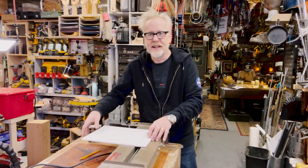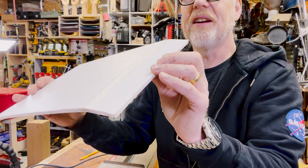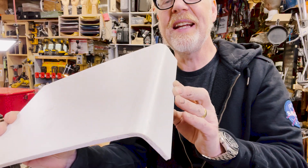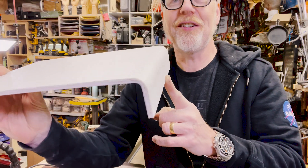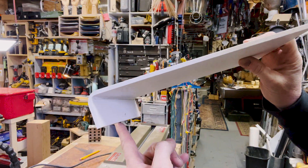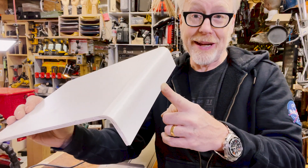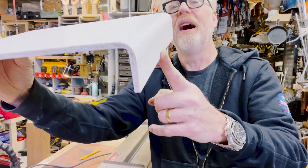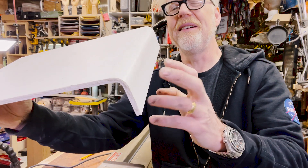I'm going to turn this off, pull off the weight, and here we have this piece of plastic which has been heating. You can see it's slightly discolored — I might have left it on there just a little bit too long — but look at this. Now I bend it, and I get this beautiful linear bend. Look at that — that's a real professional bend. I really dig that bend. This is terrific. You can hit this with a spritz bottle if you want, or just wait for it to air dry. You could make yourself a little clamping system, just clamp it to something so that it holds while you're setting it. This is how you heat a long strip to get a nice factory-looking bend out of PVC.